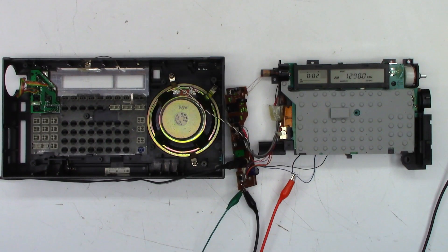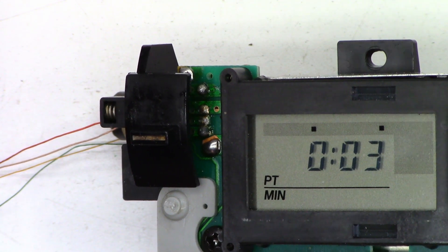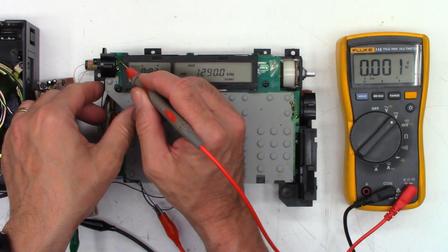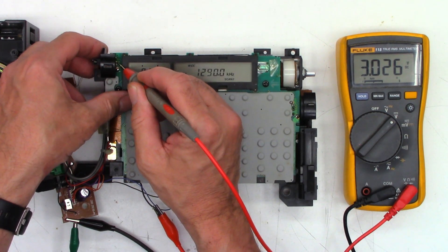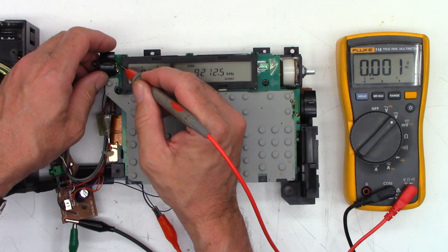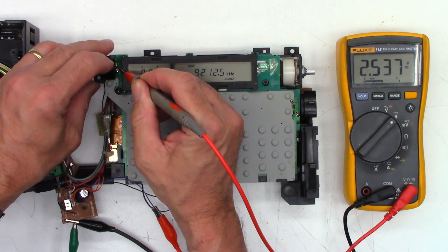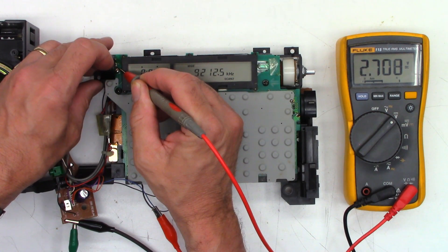Here is the power switch, and here are the two 1 megaohm resistors R556 and R557. I need to find those and measure the resistance to ground when the unit is turned off — or preferably measure the voltage across them when the unit is turned on and off to see if there's any change. I certainly didn't intend to go down this rabbit hole, but here we are. If I tip this up right here, look what lives underneath the power switch — I can actually just make measurements right on the switch. I've got the radio powered on, I can measure the 3 volt source right there and it's perfectly fine. It turned off and back on. Putting it to the on position: the top pin — that's going to be the timer input. There it is, timer on, so now we know this is 3 volts. This one right here has to be the power on/off switch. There's the problem — on: 3 volts, off: 2.7 volts.